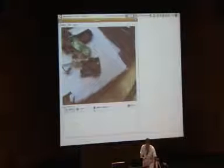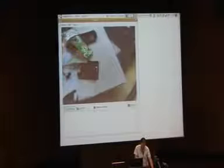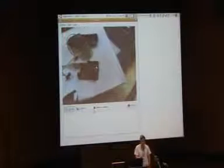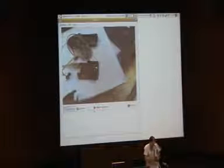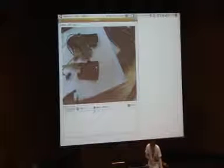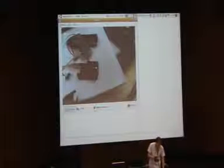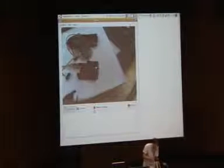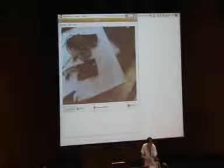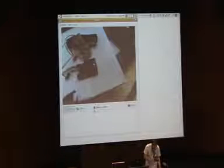Okay, so what we have here is an Arduino with the reed relays wired across a couple of outputs, and the outputs from those are then wired across the buttons onto this appliance remote control. I'll stick the receiver in somewhere so that we can see it. I don't have anything to switch, unfortunately, but when the receiver turns on, this red light should come on. There will be some indication at least.